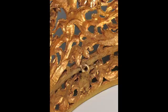And unfortunately, these eye hooks were situated directly in the path of where my mount needed to go. And going around them would require making a wider mount, which would have covered over more of the piercings. So this meant that the part of the mount that needed to be the strongest and the most robust would need to either go up and around and over these eye hooks, which would have been a massive eyesore, or a cavity needed to be created in the arm to accommodate them. I decided that the cavity was the best solution.